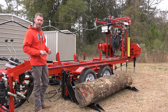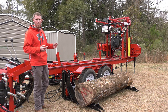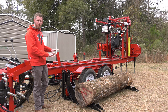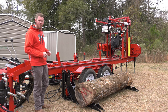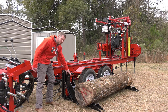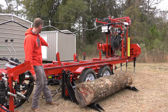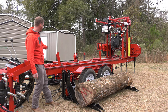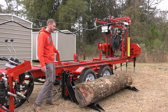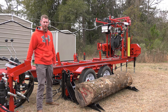I do offer a debarker for this mill, but after I take my first few cuts and rotate it, I would no longer use it. So that's some of the reason that we're set up the way we are. It does give us a little bit better performance. So the 4 1/2-inch plate arms on the log lift dump over to our dog clamps, which move up and down, in and out. Heavy belt log turner to rotate the logs, squaring arms to square us up, and then our toe boards there to adjust the level of the log.